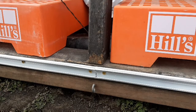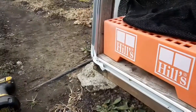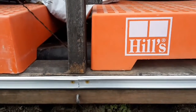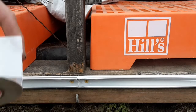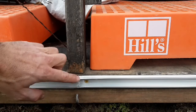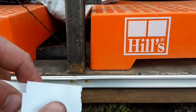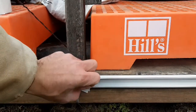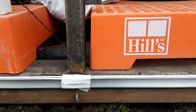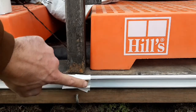I have my channel all the way around now. But at each of the junctions where two pieces go together, or where they meet on the corners, I like to put some tape on to protect the edges. We have such strong south winds and north winds during the winter that I like to give it a little protection, so when it's buffering around and rubbing on this point it just doesn't consistently tap, tap, tap and tear a hole in that section. So what I do is tear off a piece of tape, lay it over, add another piece so it's two pieces thick, tear it off, go from top to bottom so it's wrapped around both sides, take a knife and cut it, and push it on the inside. Now I want to put my wiggle wire in here — it'll have a nice smooth surface to go up to.